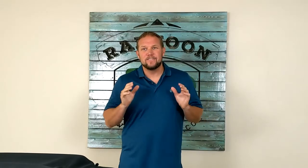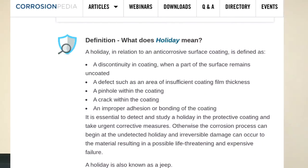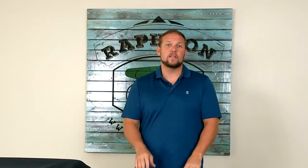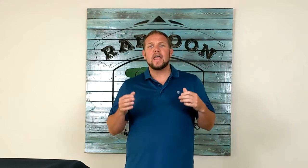When we're talking about holiday detection, it's very important to know what a holiday is. Holidays are defined as either a missed coating spot — an area where you didn't put anything — a discontinuity or pinhole that goes down to the substrate (in pipelines, we're talking about steel), or thin film thickness. Because that's the definition, a lot of people think that a holiday detector like the SPY 785 or similar portable holiday detectors for pipelines will pick up thin coating thickness. The problem is that if you've got a coating with a very high dielectric strength, it takes a lot of voltage to break that coating down to create a pinhole that it will identify as thin coating.